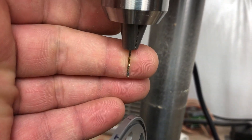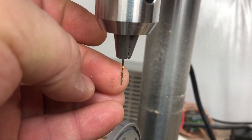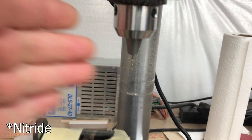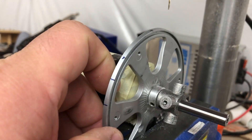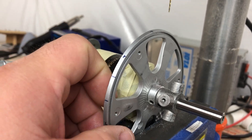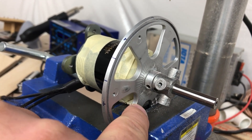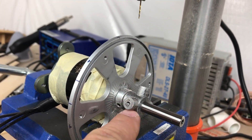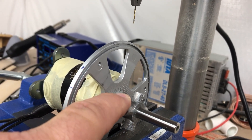So we have this little bit. This is a one millimeter bit from McMaster Carr, and it is titanium nitride coated to help with the cutting. Now this is a cast aluminum backplate for a spinner and it actually has been balanced. You can see a little drill spot here where it's been balanced. There's a whole bunch in other spots too, but this is the 3D printed aluminum hub for everything that goes together. So that doesn't get anything done on this.